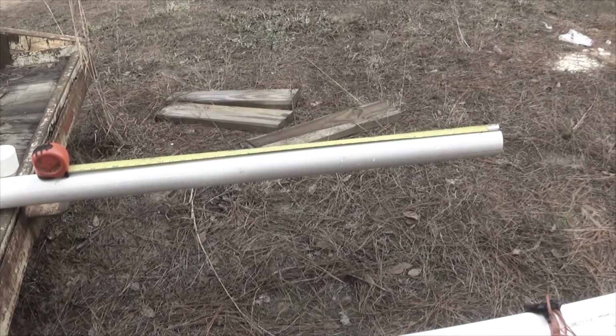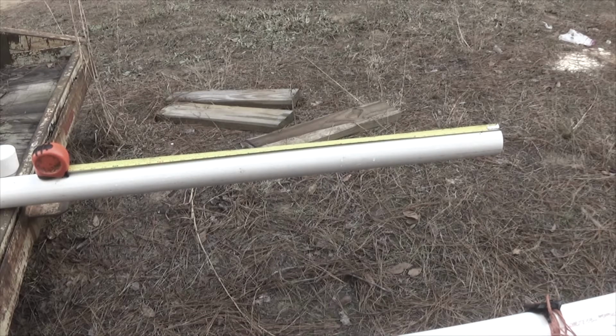This is the pipe size that he selected. It's 2.5 inches. The gentleman decided that what he was going to do was go with 5/8 inch. Instead of having 9 lines, he'll actually have 18, and they're going to be staggered on the 1/2 inch centers after the 1 inch centers are drilled. So he'll have twice the volume of the 5/8 as originally designed.